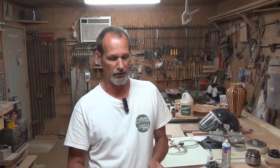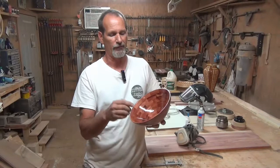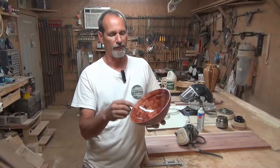We'll go over a solid base too. It's very important to get the size of your segments right. With this bowl we did 24 segments — if you're an eighth inch off, by the time you cut 24 segments, you're 24 eighths off. So that's like three inches.